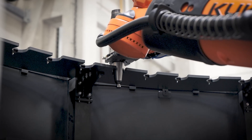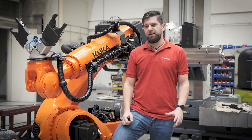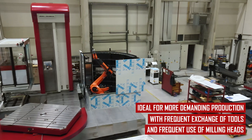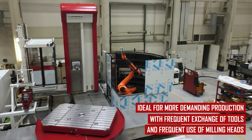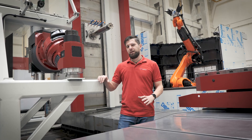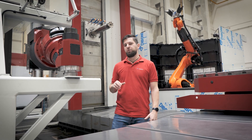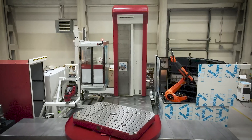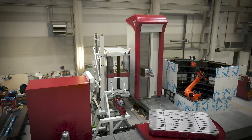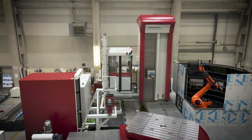As you can see, there are many advantages of a robot over an ATC. Probably the only downside is the price. However, this is always a good investment for more demanding production, where there is a frequent exchange of tools and a frequent use of milling heads. It is necessary to say that both the ATC and the robot can only be used with milling heads that are automatic — specifically, milling heads that are automatically positioned, so that we can guarantee the precise position of the spindle during exchange, and milling heads that have automatic clamping and unclamping of the tools.